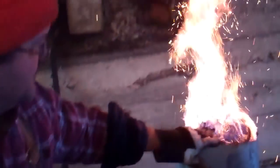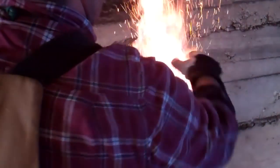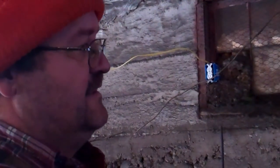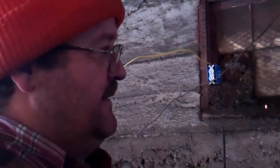And then with my stopwatch, I watch the rate until it burns down level. And then I can use that to adjust my airflow. Essentially, Lee Sauter is kind of the guru of smelting in the United States, and actually all over the world right now. He's come up with calculations of airflow rates that are gauged by how quickly it burns charcoal, because it takes so many liters of air to burn so many kilograms of charcoal, to a complete combustion. So based upon the square area of your flue, I think his magic number is 0.35 grams per square centimeter per minute of charcoal burn rate. It took him a long time to figure that out.